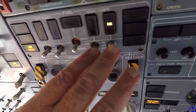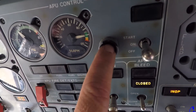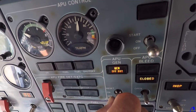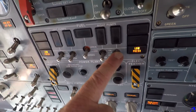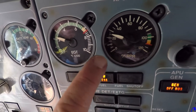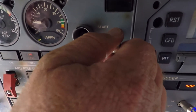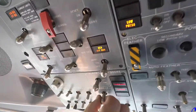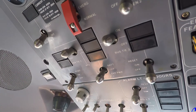Once we're at that one-minute point, we come up to the APU and press the switch — APU shutdown, generator off, fuel pump off. We wait for the APU to spool down, cancel the alarm. At 20%, put the APU master off — 20%, APU master off. Come across — emergency lights off, power switch off.